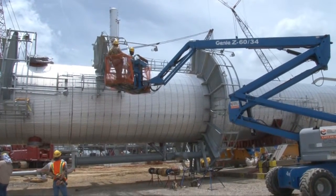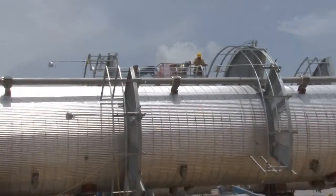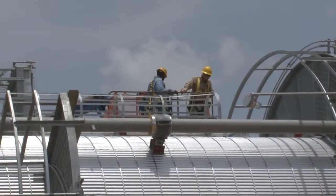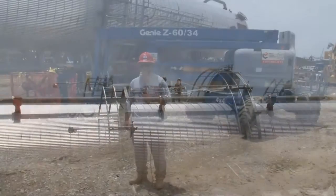An aerial lift variance is required before personnel will be allowed to exit the basket. A variance will only be issued if it is determined that no other means of access can be done safely. Exiting the basket must be done through the gate only. There must be a qualified operator in the basket at all times. The aerial lift must be turned off and is not allowed to move. Also remember, an employee outside of the basket must be tied off outside of the basket.